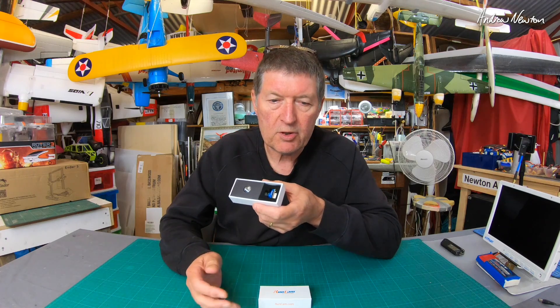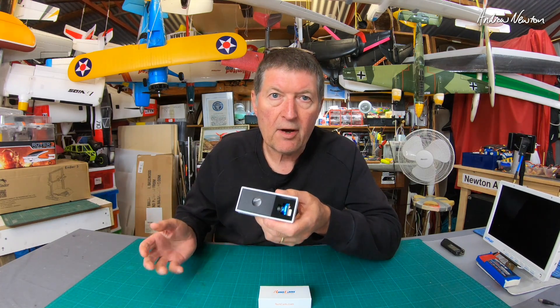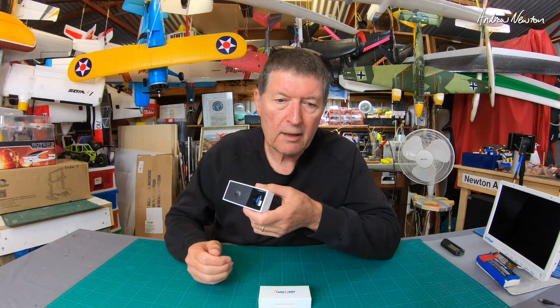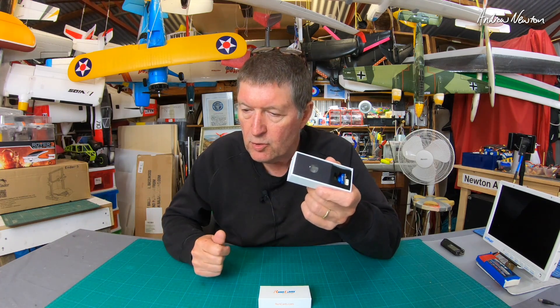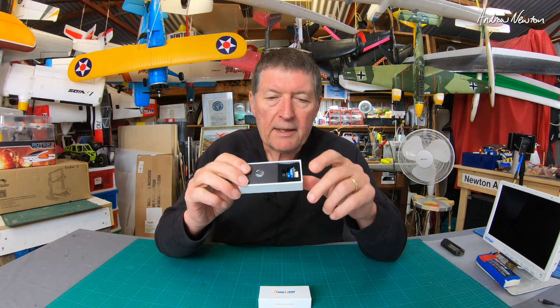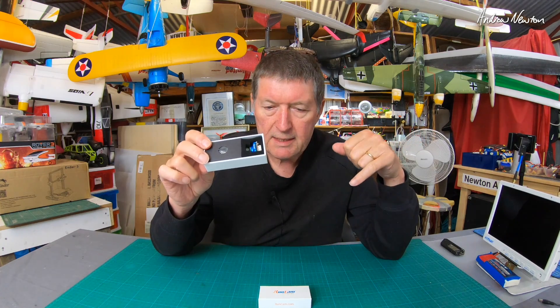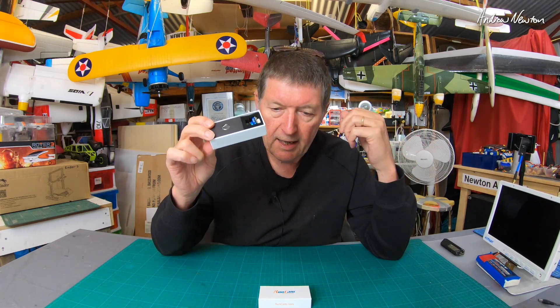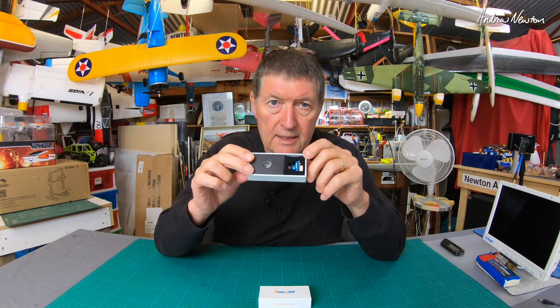That's a fair bit cheaper than the Oscar version. It's 4:3 aspect ratio, switchable to 16:9, NTSC or PAL. It has a half-inch sensor and an f2 M12 lens. In the marketing they say it has less of that digital shimmer that the Eagle has, better low-light handling than the Eagle and the Oscar, less red sun flare, and less purple fringing as well. Same latency as the Eagle.